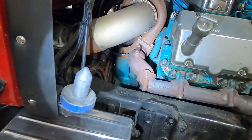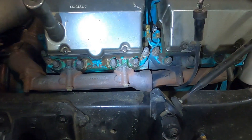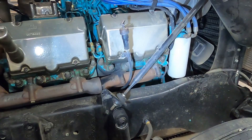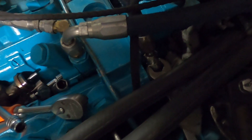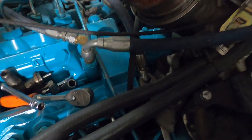You just got to always watch the pyro. This thing does have marine injectors in it, so it is putting the fuel to her - you just got to be easy on the old right foot. Before we pull the delivery valve apart, I'm going to take the inlet fuel line to the injection pump coming back from the secondary fuel filter and take that line off. I'm going to take air and blow through the galley so it'll blow back out the return to the tank. That way we get all that fuel out of there, so once we pull that delivery valve and we start blowing air through, we won't get a bath in fuel.